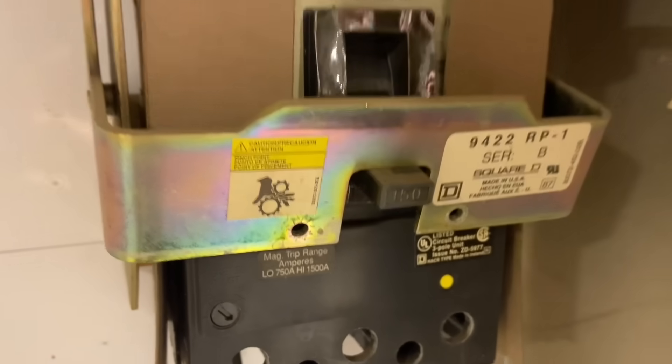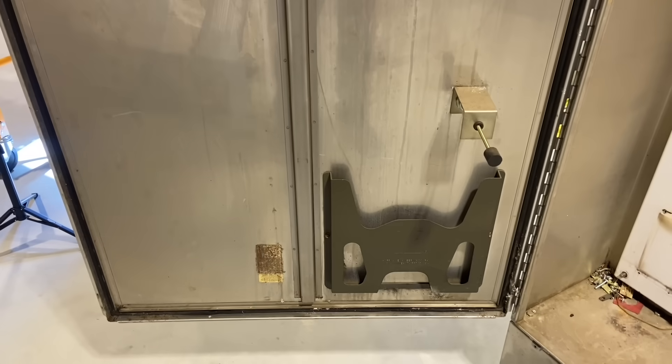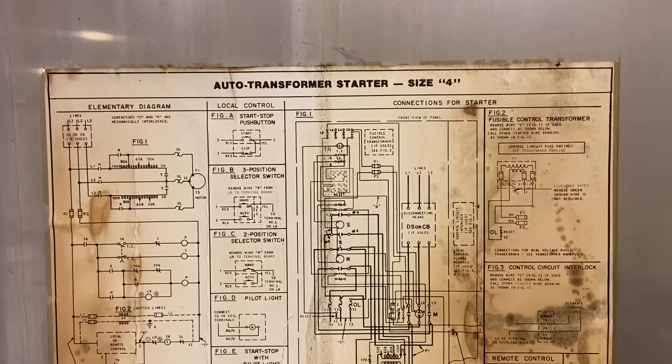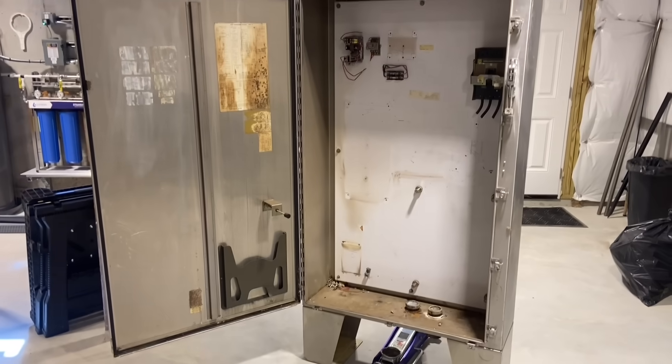Anyone need a 150 amp breaker? I don't know if it's good, but you can find out. Investigating further, it looks like we got some fuses, an old timer relay or timer contactor, and it must be old because the relays are mounted directly to the back plate with flatheads — and we all know how much the old timers loved flatheads. It is a Hoffman enclosure, so definitely a name brand. And it does have a diagram — an old auto transformer, Size 4. That explains the big studs. If you don't know what that is, it's just like an old school soft start. It starts the motor at about 30% voltage and then switches over to full voltage.